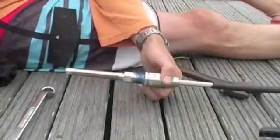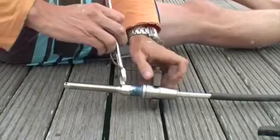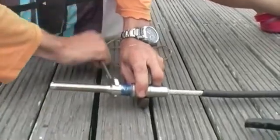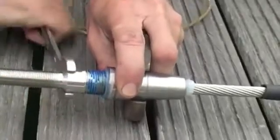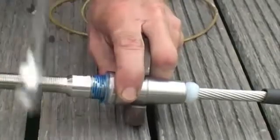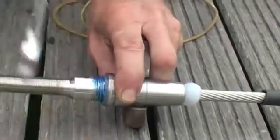As you're doing up the stud, you've got to make sure that you've got silicone pushing out of the head there. If you're not, then you need to pull it apart and put more inside. See the silicone pushing out the top there? It's beautiful.